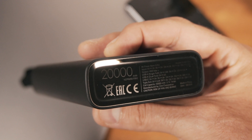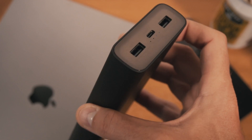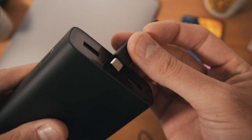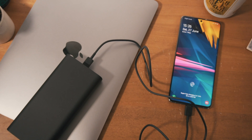There are two main problems that I typically find with these power banks. The first is just an unfortunate industry standard: using milliamp hours to describe the amount of capacity you can expect. The issue is that that measurement is at a set voltage which you're unlikely to be using to charge your devices — it's probably impossible to actually get 20,000 milliamps out of this thing even at 100% efficiency. The second issue is efficiency whilst fast charging. Whilst many of these power banks may be able to fast charge your device using one of the various fast charge protocols, in doing so you often rapidly reduce the capacity you're going to get out of these cells due to poor efficiency.